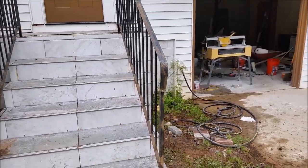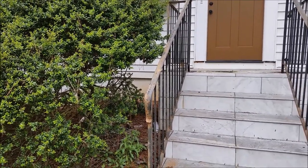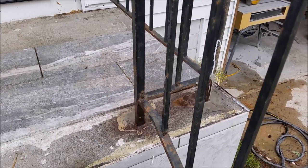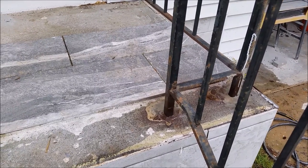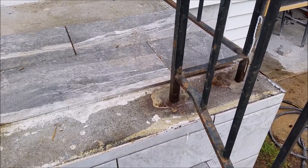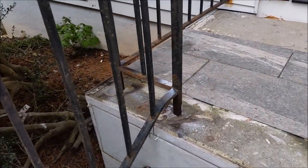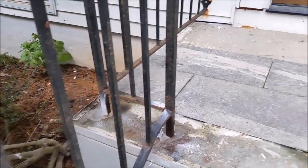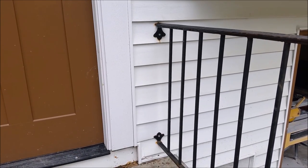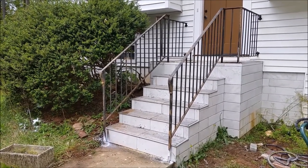The other thing is that the old railing is very rusted, so we're going to use a grinder to clean the railing and paint it. Let me go upstairs and show you what's happening. We cut the old rod and welded a new rod inside, put two coats of primer — clean primer — then put the brown top coat color that protects from rust. Here we're doing the same thing, still adding the rust protection coat. We attached the railing to the wall of the house with screws, as you can see — that's what it used to look like before. We'll leave this railing for at least 24 hours and then come back to see the result.